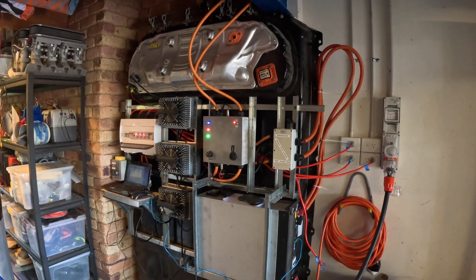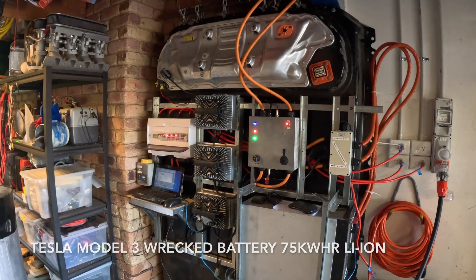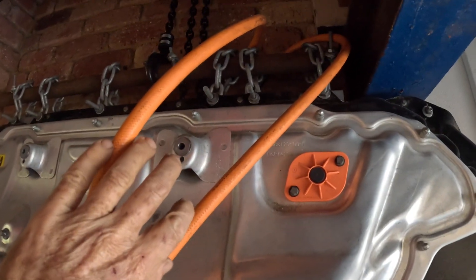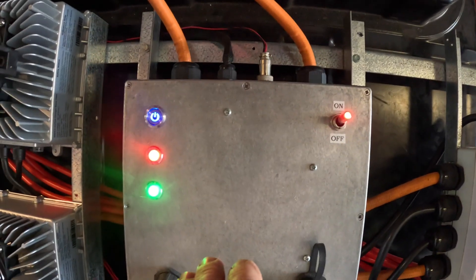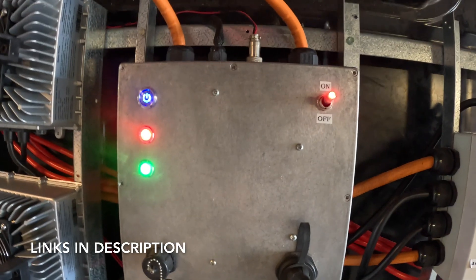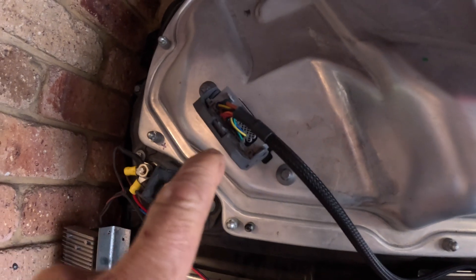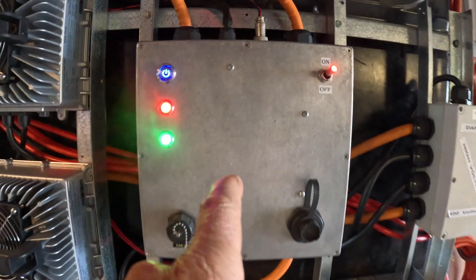This is my battery system — I've been running on this for three weeks. It's based on the Model 3 battery, which is from a wrecked car essentially. The high voltage — 400 volts DC — comes from the battery here and it goes into this box. This is made by EV TV. What it does is trick the battery into thinking it's in the car, by talking via the CAN bus to the battery. The battery is very intelligent.